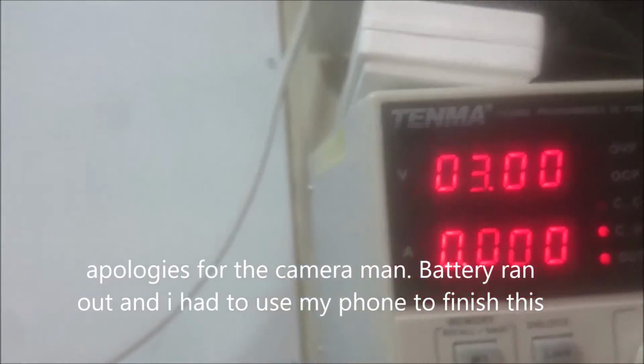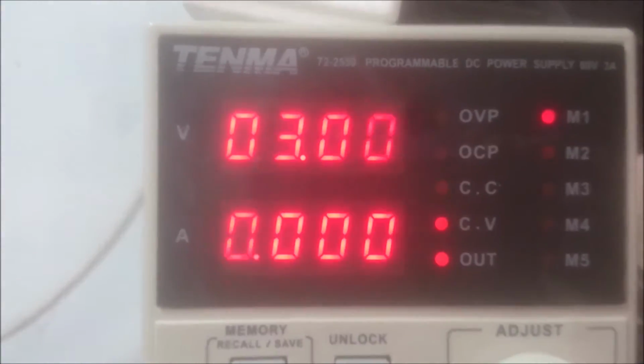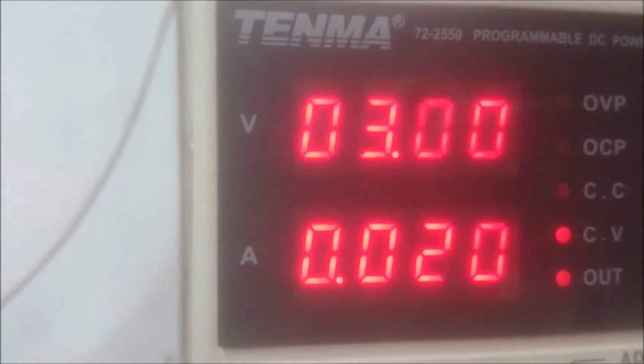Okay, so we've put together our Vox Amplug. After we've removed the short, I measured the resistance across the battery terminals before I put everything together, and now you see this is in standby mode and we have no current being taken. Phew! After all that. So 20 milliamps when it's on, and nothing when it's off. Let's have a look, see if there's any microamps still there.